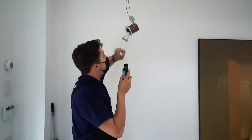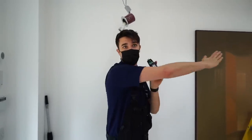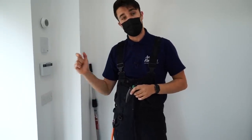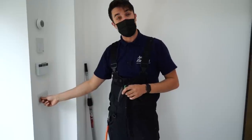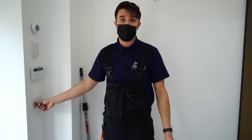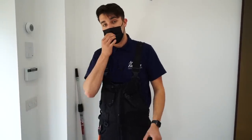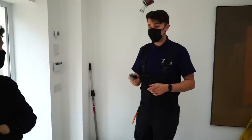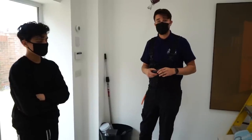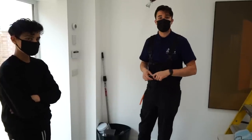Out of the old light fitting, through to the lights right up to end of line - that means everything downstream is powered by this controller. Inside the switch, because we don't want this switch anymore, we want to be using the Pico remotes, so we'll link that out so it's got a permanent feed. It's literally as simple as that. We'll talk you through the process as we do it, and show you the programming, which is also stupidly easy. Thanks for watching - any questions, stick them in the comments below.